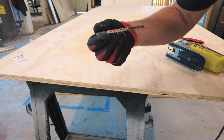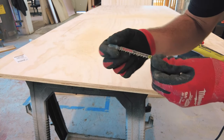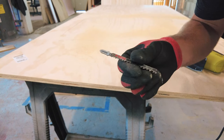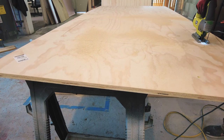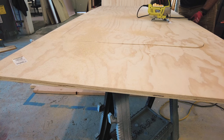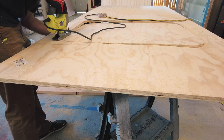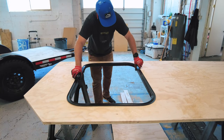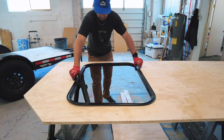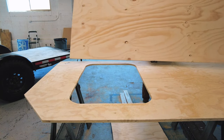We're using a Diablo fast-and-clean wood jigsaw bit — I'll put this down in the description. The jigsaw seems to be the best and most accurate way of cutting the rounded corners of the door opening. Just go slow and it should look halfway decent. I then bring out my door trim just to double-check and make sure the opening is big enough — in this case, it was perfect.